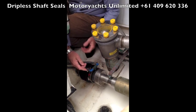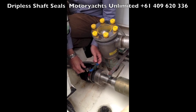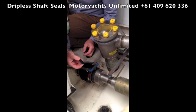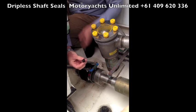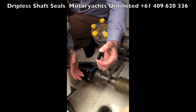What can occur is when people are working in the engine room — be it mechanics, detailers, whoever — they can put pressure on this fitting. Because they're only nylon elbows and a nylon tail, they can easily snap this off. Once that's snapped off, water starts coming into the engine room.